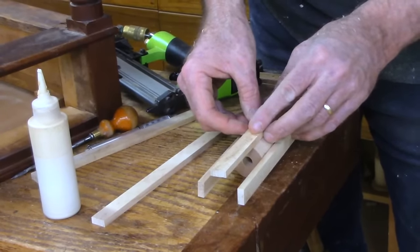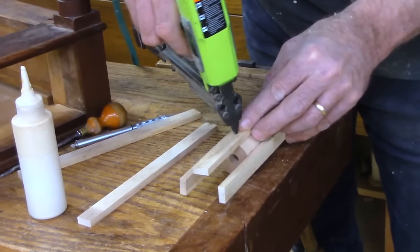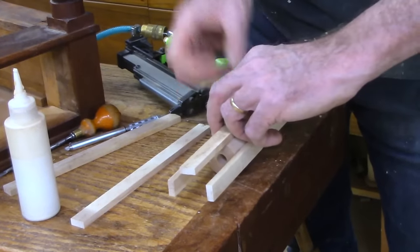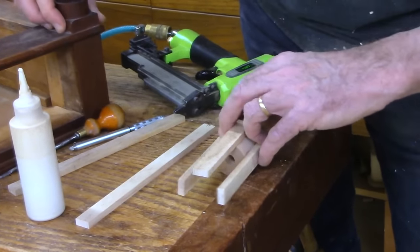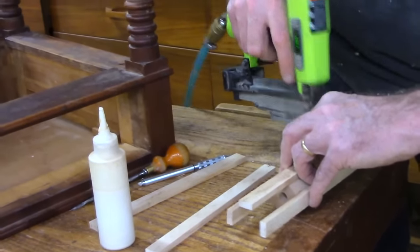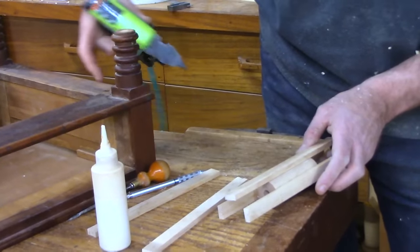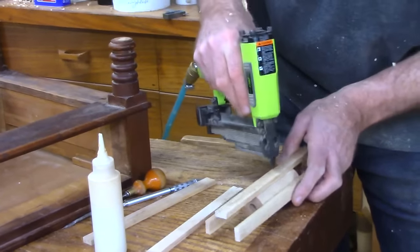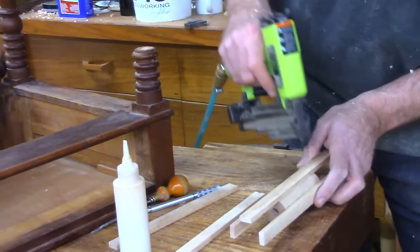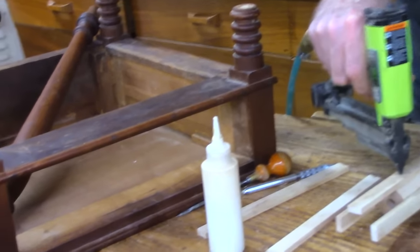All right, so I'm just trying to get this one about 90 degrees-ish of that one. Michael's curious, does the original leg go all the way to the top piece or does it stop at the lower frame? That's the original leg. Oh, yeah, it goes all the way through. Yes, it's definitely all the way, and then it was veneered. So because of the way that it's got the tenons running in this way. And I forgot to mention that the sides are, you can actually see the tenons. They're all mortise and tenon. The sides are into the legs.